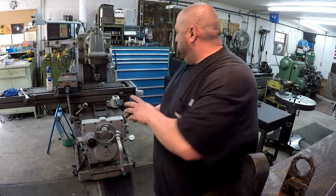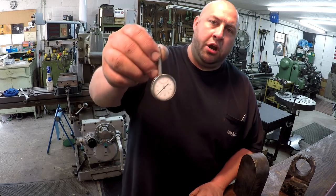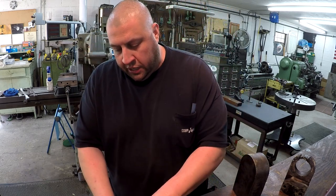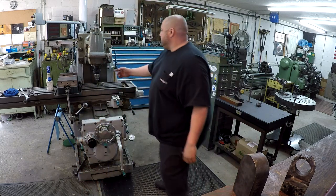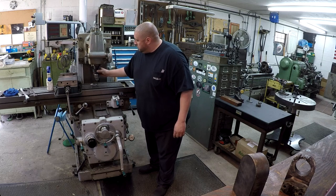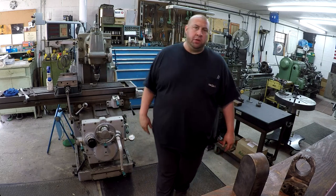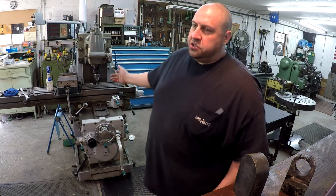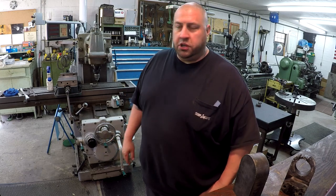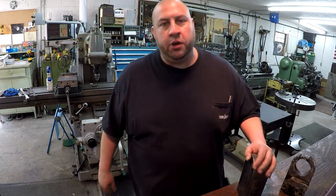actually the one that Mark had repaired for me over at MR Tool Repair. But it's a Starrett 196 like this, a back plunge. And just got it clamped in the drill chuck there. And just indicating it, sweeping it in. And I've got it zero-zero, but it's actually zero all the way around, so it's trammed in, as good as I can see with the thousandth resolution on the dial. So I believe that's pretty good. We're going to leave it there. So I'm going to get this dressed up, and then we'll see you on the milling machine, okay?